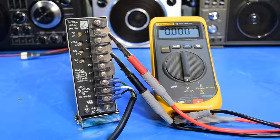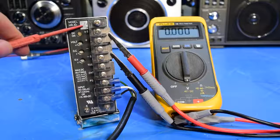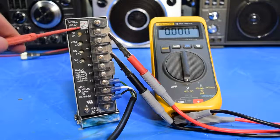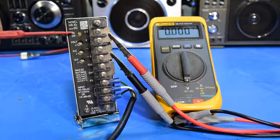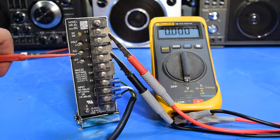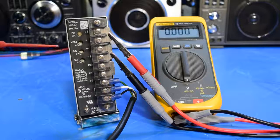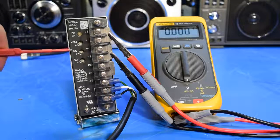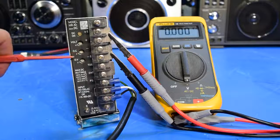Before I get into testing the power supply, I'll go through some of its features. Up here is the model number, HR10. This is the voltage rating and the current rating: 12 volts and 5.0 amps. This LED is the DC-on indicator. This control sets the output voltage. This is the overcurrent adjustment, which would protect the power supply from supplying too much current and can be adjusted accordingly. There's no meter on here, so you don't know exactly where you'd be adjusting it without putting a meter in line, but the adjustment is there.